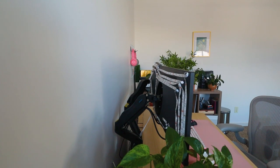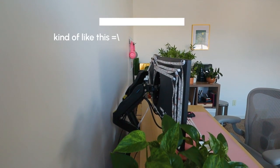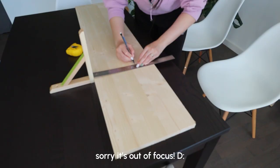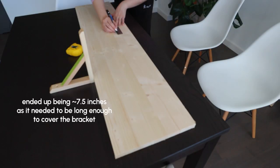The next cut is that I want to make sure the shelf isn't too wide and doesn't come out from the wall too much. With the piece of wood I got, I'm worried that once I put it up on the wall, the shelf is going to extend past where the monitors are. And it's going to look kind of weird, like there's a ledge or a shadow just hanging down from my monitors. I don't really want that because I want it to be as bright and light as possible. So I want to make sure the shelf is not going to act like a roof over it, I guess. So when it comes to that, I'm thinking of cutting it to 7 inches in width